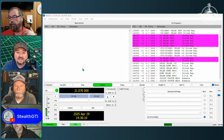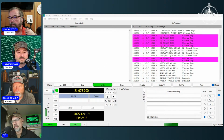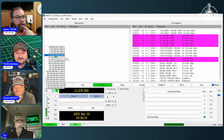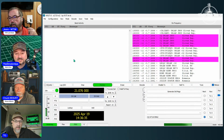Yeah, but we've only been through one receive cycle, I think, in the last 2 minutes. But there might be rules around the frequency you're supposed to use. You know what I mean? If you're not familiar with the mode, sometimes you just never know. Well, I'm assuming, so right here, 20 meters is at 14076 instead of 14074. So WSJT is adjusting the frequency for me. I don't know about rules, but 15 meters has been really good for FT8 lately.